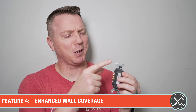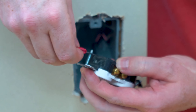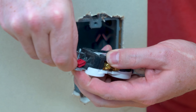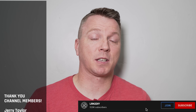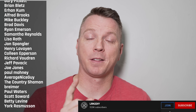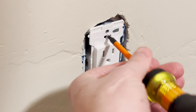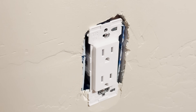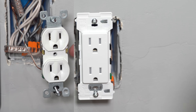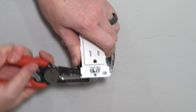There have definitely been times when I wish I had a little more of this strap to work with — this is the part that sits on top of the drywall or wall panel, and if that's not cut properly, you have to use spacers, fix the drywall, add something to the paneling, or even put a box extender on there. The Decora Edge comes with an extra roughly 1-1/8 inch tab on both the top and the bottom, giving you that much more room to work with. It's actually quite a bit wider and taller than a typical outlet, and if you don't happen to need that extra tab, it'll just take a couple of seconds with some pliers to snap it off.